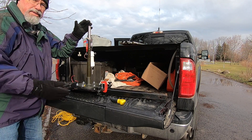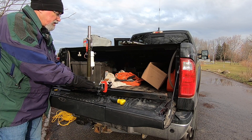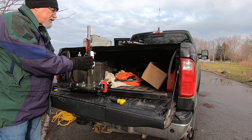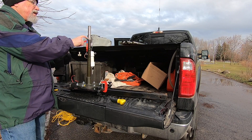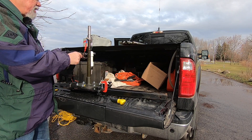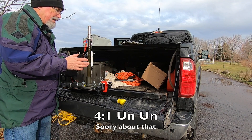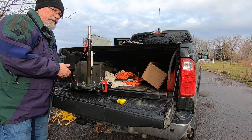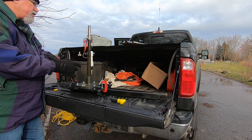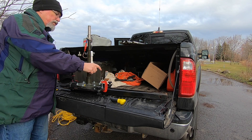First of all, this is the antenna mount — a six-bolt unit, aluminum cast aluminum plate on a fiberglass post. There's a bolting area for the hot lead of your antenna. I've put on a 4:1 balun, which balances the antenna quite nicely and allows me to load it up anywhere from 40 to 6 meters without any issues and without using a loading coil.